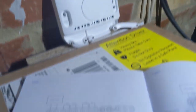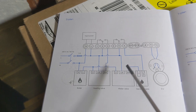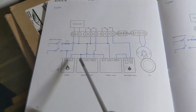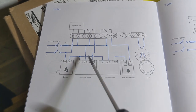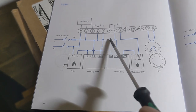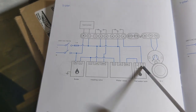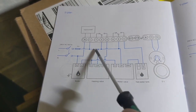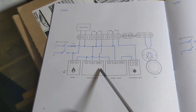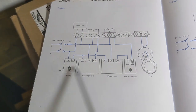If you're not sure, it does come with the wiring diagram which looks a little bit more complicated than it should be because you've got lines and wires crossing all over the place. But ignore all of that - just literally look at this: live goes to two, two goes to five; all of that is already done in the wiring center so you shouldn't need to worry about it. You're just looking at live to two to five, three going to the brown on the heating zone valve, six goes to the common on the cylinder stat. That's it.